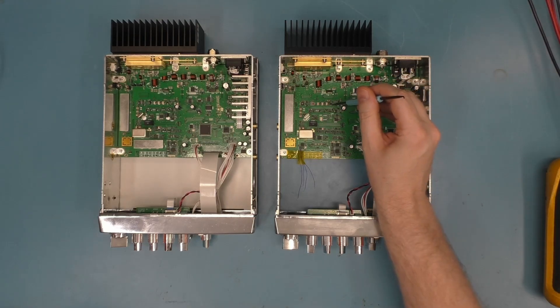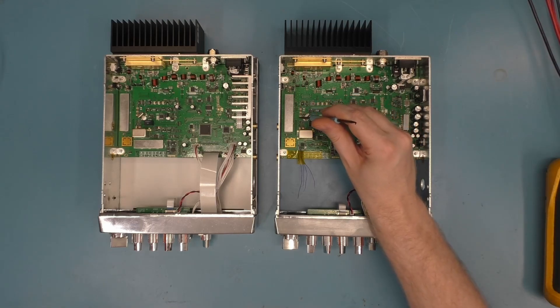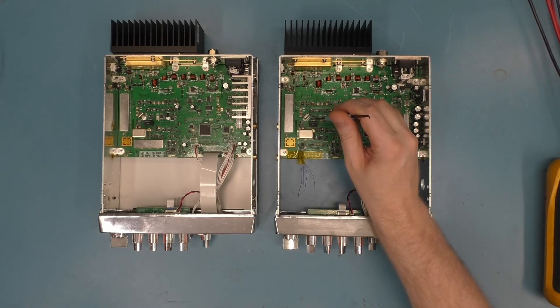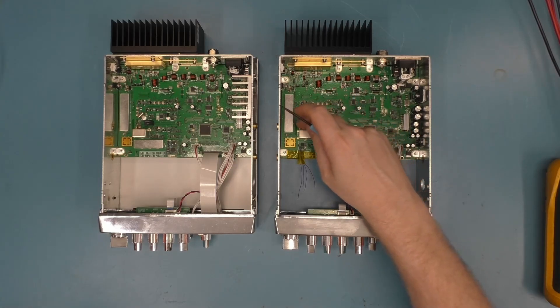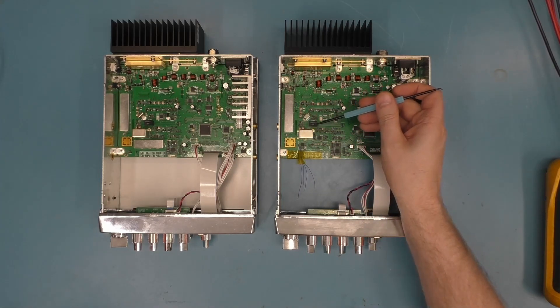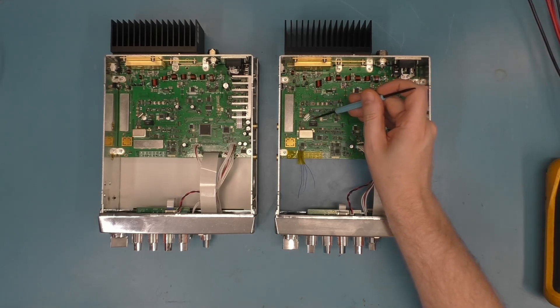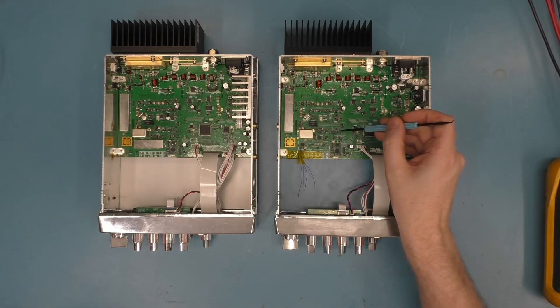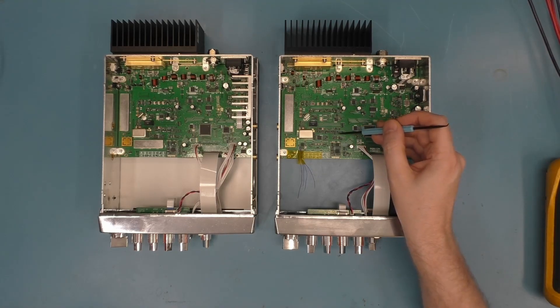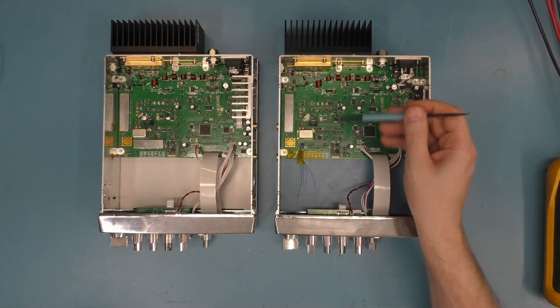The receive chain has a low-noise amplifier, a tunable bandpass controlled in software, mixer, bandpass, more amplification, and then either goes through a monolithic crystal filter or another IF stage down to 455 kHz. After that it ends up in a strip where the AGC is tapped off, goes up to an op amp, and that op amp controls the AGC on the receiver — that's literally it.